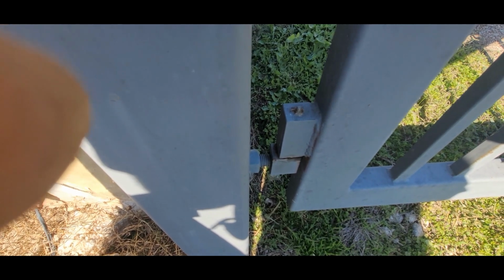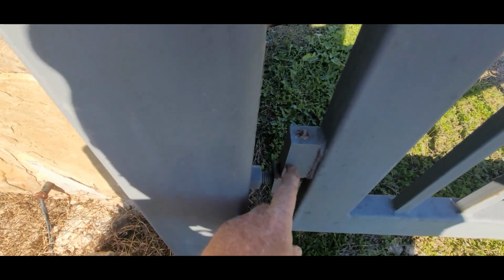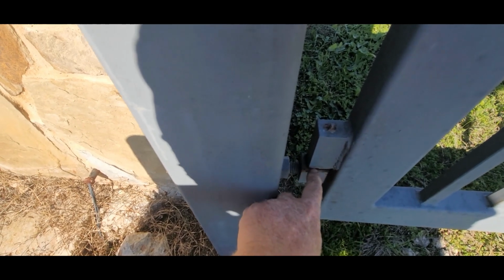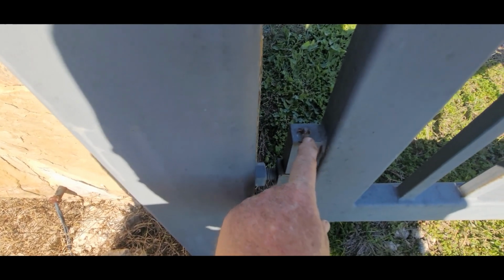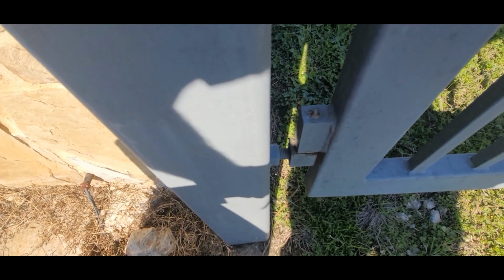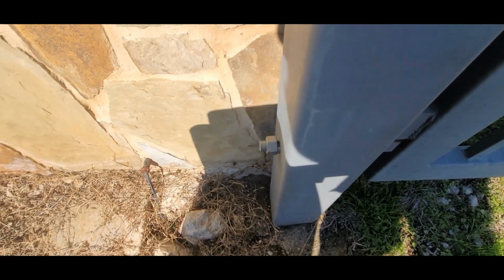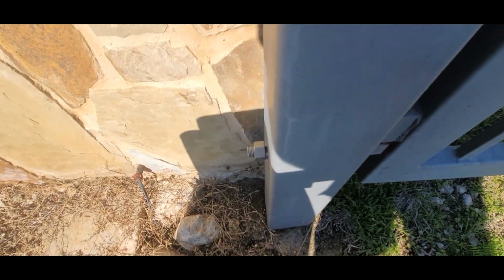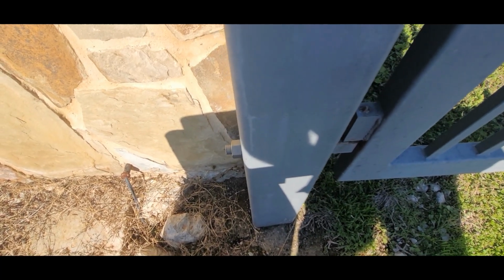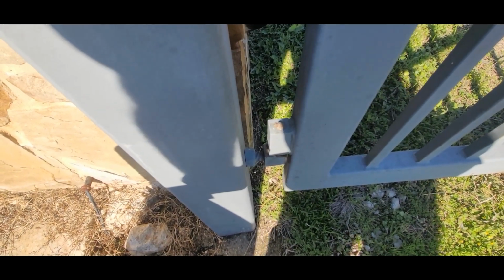Anyway, these hinges are designed to be installed just like that. If you turn this upside down, then all the water goes inside this from this joint right here. It doesn't rest on the ball bearing. You can't grease it worth a dang, and it rusts shut. So don't do that. This one also, you can adjust it back and forth as needed, because ground moves. Gates sag. This way you can do some adjustment without having to cut everything off and re-weld it. So many people just cheap out and weld these on.